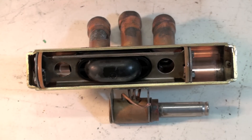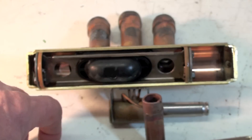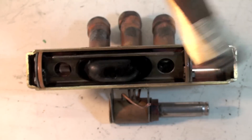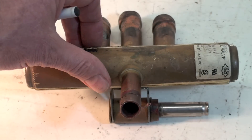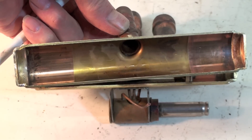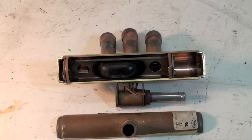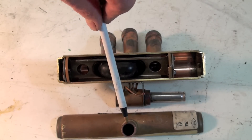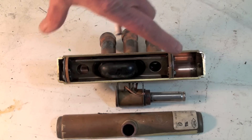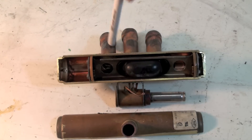Now let's talk about how the discharge line reverses. The discharge line goes right in like that into the body of the valve — the open part of the valve. When the slide is in this position, discharge goes from here down and out that port. When it shifts the other way, discharge goes from here out the other port.